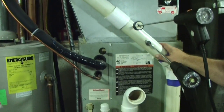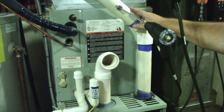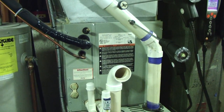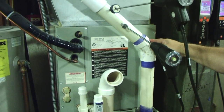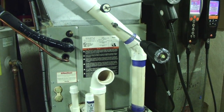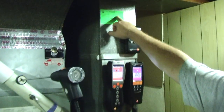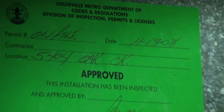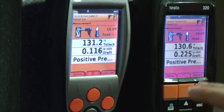What we're going to do — we're not going to do it today, but when we both get some free time, Eddie's going to help me. We got our chart out and I'm going to run 2½-inch. With the 2-inch, we're allowed to run 30 feet total. I'm at about 18 feet on my PVC here, but you're adding 5 feet for two 45s and 5 feet for a 90. I've got a 45, a 45, and a couple of 90s back here. I've been running like this since 11/18/08 when we had this furnace inspected. What's so fantastic about these tools is we're actually going to be able to test this again and show you how significant the reading is going to drop.